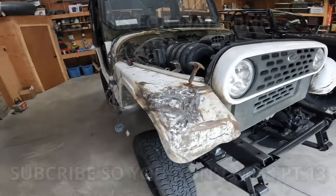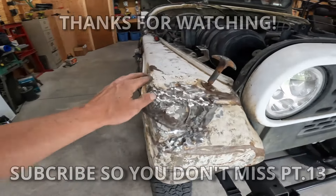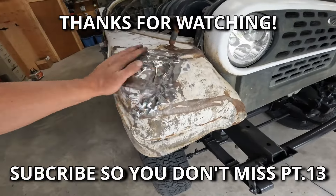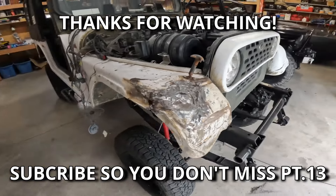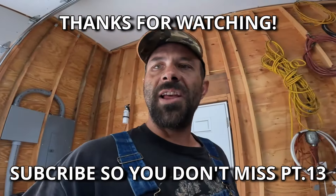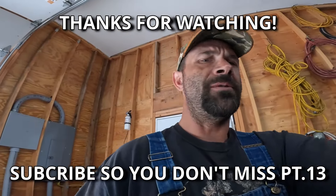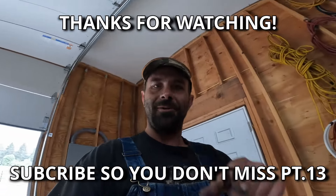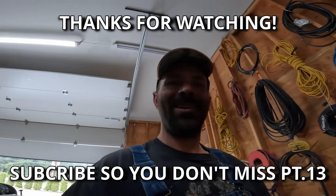All welded up and done. Now before I show it to you, it might look a little ugly, but perfect isn't what I'm going for — I'm going for classic. I'm just trying to make it so people don't get cut on it and it doesn't crack out any worse. I tacked it up everywhere, hit it with a little sanding disc real quick, knocked the highs off, and you can rub your hand all around it — good to go, can't cut yourself. We'll put a clear coat over it. I don't want to fully paint it and make the rest of the rig look bad by comparison. All right, we'll see you on the next part — y'all have a good day.